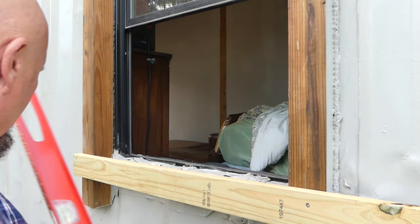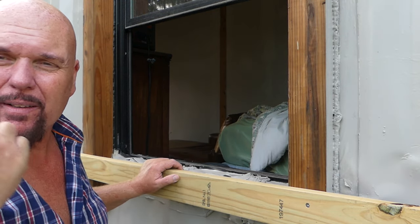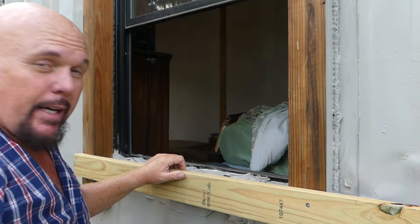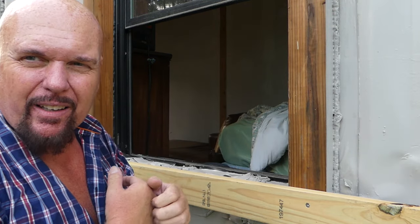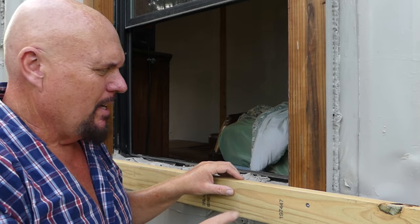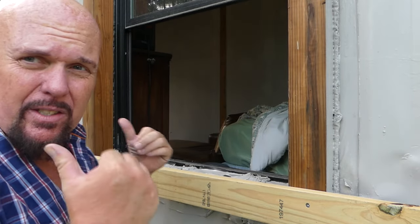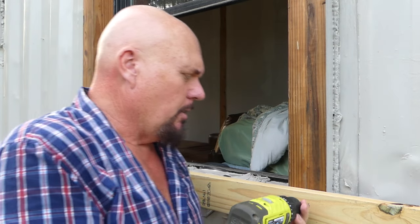I'm going to guess that the AC unit will need a little angle this way so that it'll drain, but let me flip the bottom up and take a look at it and see if it's flat or if it has a little convex. For some reason, I didn't buy the plate on the bottom. It's probably $100, and I thought, oh, I'll just do this. So, it's reasonably flat. There's a little bit of angularity in there as they molded things around metal. But I'm going to get this better so that the AC unit has a little angle, so it drains water out instead of in, and hopefully doesn't mold at all. I'm hoping the sun comes up every day and dries it up. But nevertheless, I don't want water in the house.